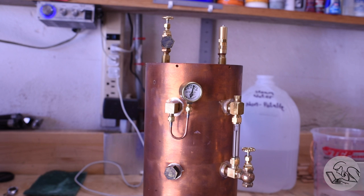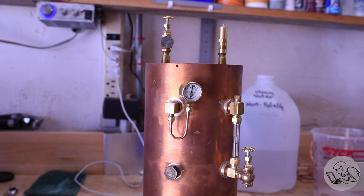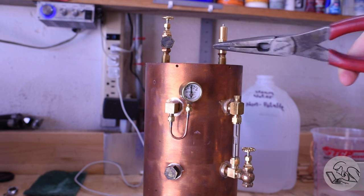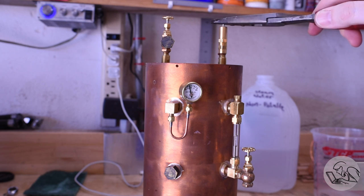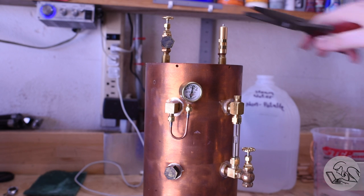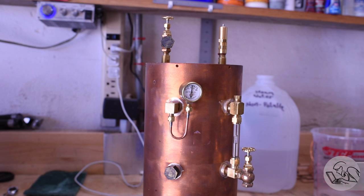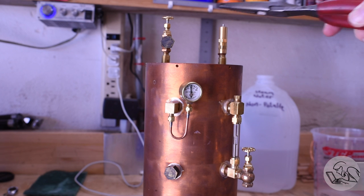It's reinstalled and building pressure now. I'm flirting with 70 psi and it hasn't opened yet — not too surprising because I increased the spring rate quite a bit by shortening it. So I'll give it a little help just to open, and it pops open very cleanly — that's a good sign. It's blowing off very efficiently, so we definitely fixed that part of the problem. It dumps steam all the way down to 50 psi with the burner on full, no problem. However, it's not closing. Around 40 psi I gave it a little help, pushed down on the pin, and it closed very firmly — the snap-close action was very good. I think what's happening is the ball carrier is getting stuck because the cap on this valve has threads all the way up, so it's not a smooth bore for the ball carrier to slide on.